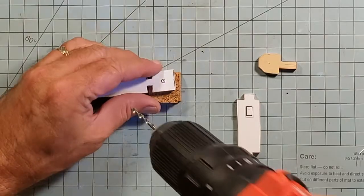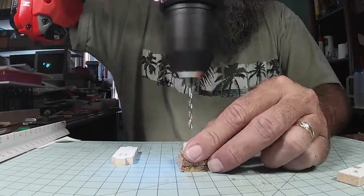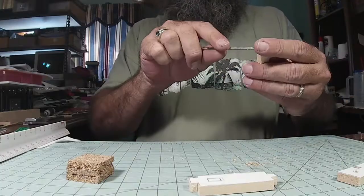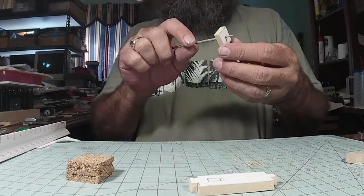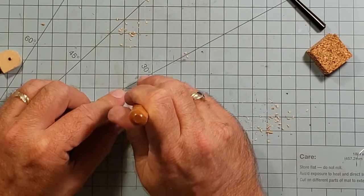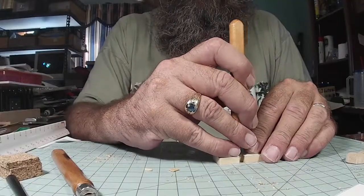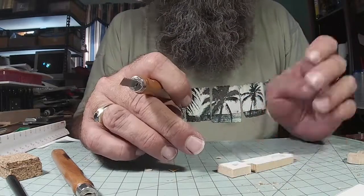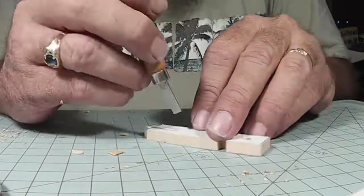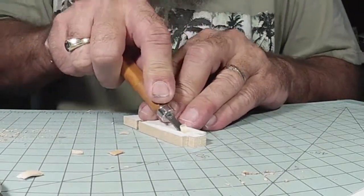Here I am drilling the hole where the live center will be — where the pulley will actually do the turning. I'm just reaming out the holes to make sure they're nice and clean. Then I'm cleaning up a little bit; it was uneven when I got done cutting, so I'm evening things out with the chisels. I'll also chisel out the holes like I mentioned. It looks like I'm missing the lines, but I actually made the holes the wrong size when I drew the pattern, so I had to make them a little bit bigger.